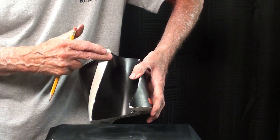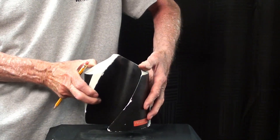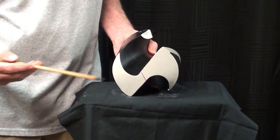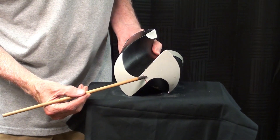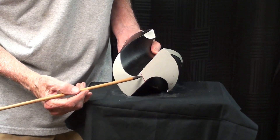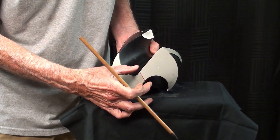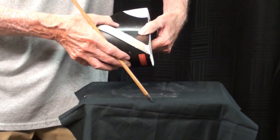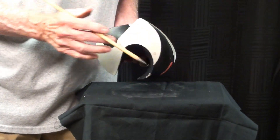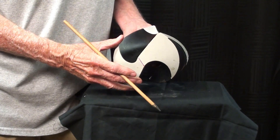This is not a cutting edge — it is on a reamer, but not on a drill. The cutting edge is the lip, which is right here. The very center portion of the drill — I put a little red mark on here — is called the web. The web is really right where I'm pinching here, and it goes down the full length of a drill, getting thicker toward the bottom. I did not do that in this model, but I'll show you a picture of that a little bit later.